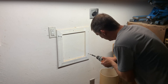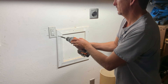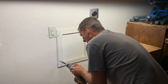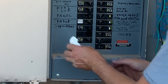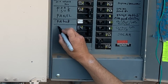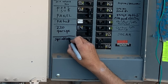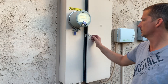After verifying the voltages, all I had left was to tidy up the Romex wire inside the wall and put the access cover back on — it slides into place and I used screws to hold it to the surrounding two-by-fours and the two pieces of wood I added earlier. I also like to label each circuit breaker I add so I know exactly what it does — just use a permanent marker, and if you need to erase something already there, brake clean and a rag works great. Hopefully you enjoyed this video and found it useful. If so, hit that like button and subscribe — the whole concept of my channel is to give you the most information in the least amount of time.